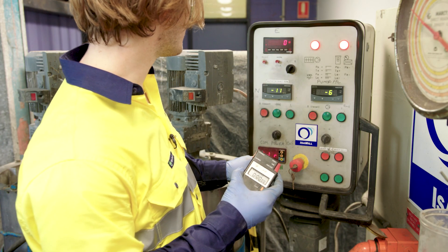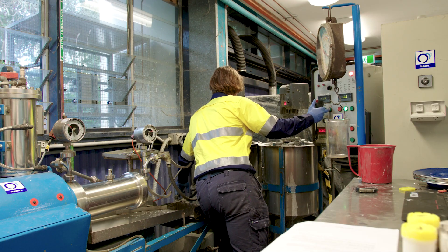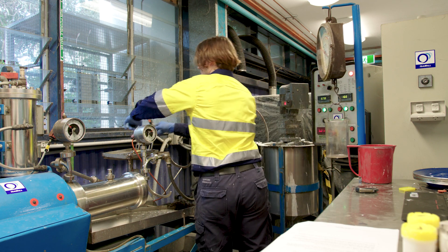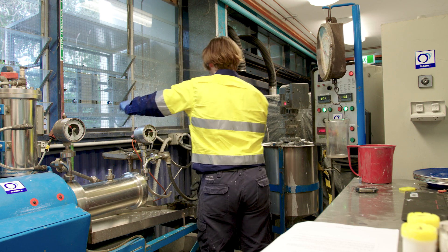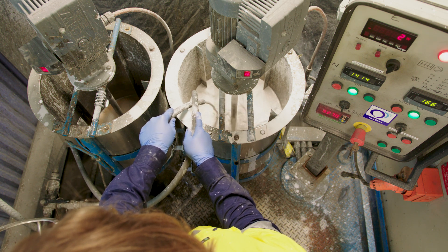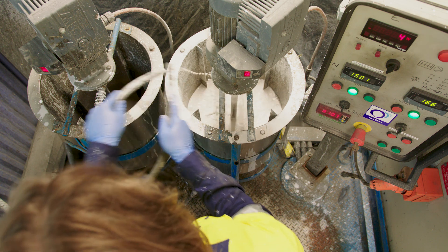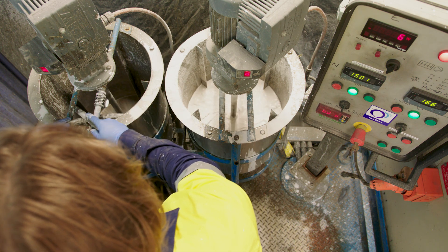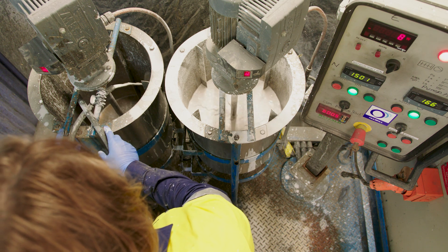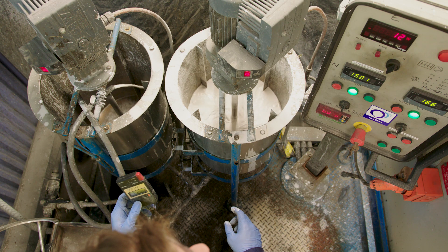Reset the cumulative power meter or make note of the starting value. Also reset the timer. Start the stopwatch and switch on the M4 shaft while simultaneously changing the flow redirection valve. The mill should not be left stationary for too long or the slurry will settle inside the mill and could potentially stop the mill from starting up. Because slurry already occupies the mill volume, slurry will begin flowing out immediately. Wait 15 seconds for the leftover material from the previous pass to be emptied into tank B before you change the lines back to tank A.